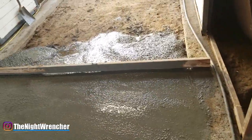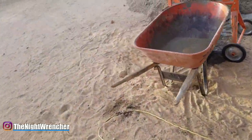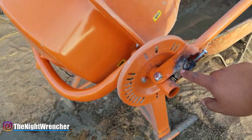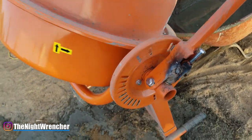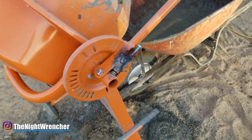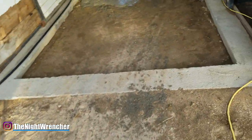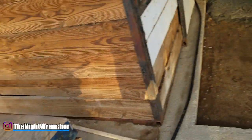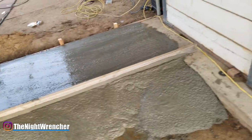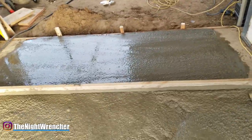I have to take a little break — I haven't gotten very far and it's probably been about an hour or two. I already messed up the mixer. It's running right now but I had to weld it back in an emergency because a part broke, which meant the mixer couldn't retain tension on the handle and it kept popping out. The part was bending and eventually broke, so I went ahead and tack welded it back. I've already gone through about three bags of cement mix and this is as far as I've gotten. It's actually going pretty well because it's about 60 degrees, so the concrete is laying out really evenly and I have plenty of time to run it. I am making it a little wet so there will be some shrinkage, which isn't terrible as long as you can control it.